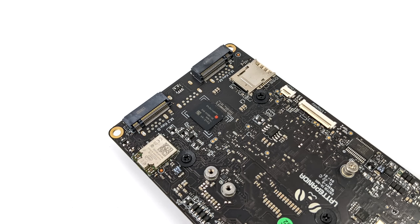Taking a closer look at the M.2 slots: we have a Key M and a Key B. The Key M slot runs at PCIe 3.0 x2 and supports an NVMe SSD. The Key B is PCIe 3.0 x1 and supports USB 2.0, 3.0, a SATA adapter, a SATA SSD, or a 4G/5G module — so you could go fully mobile with this little board.